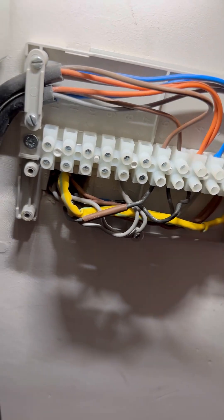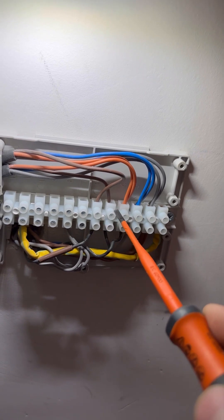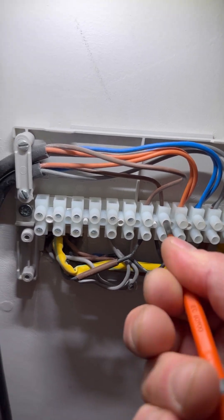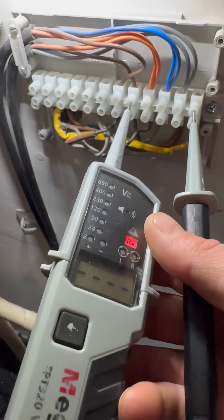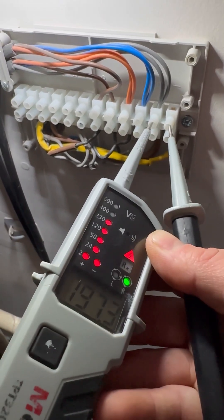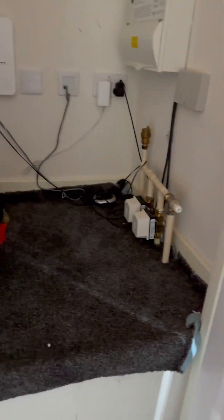So it just shows the house was four years old and it was just wired up wrong from day one. We literally flick those two around, tighten them back up, turn the power back on. So the zone valve I pointed at before thinking that was for downstairs - it wasn't. Now the correct stat is wired up to the correct zone valve and the radiators are warm downstairs. Always end up doing my basic checks, and we're getting all the voltage that we need. Close the door on this one, happy days.